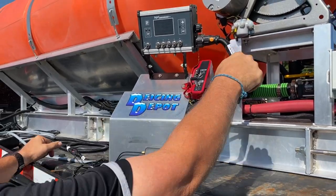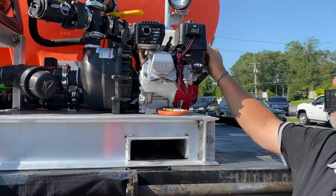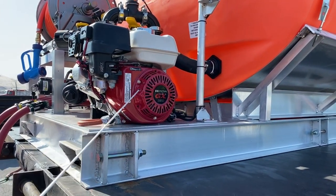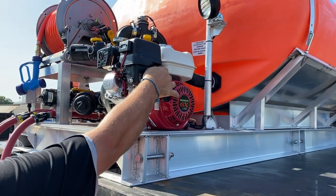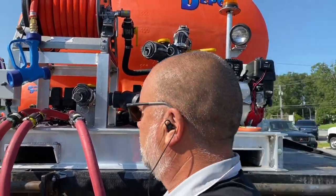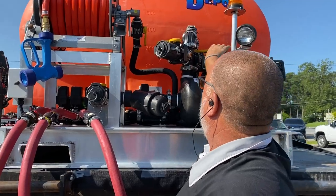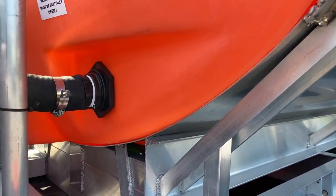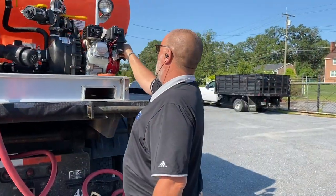To start the unit, turn the key on. Because we do not have an electric choke — it's the first thing that goes bad — make sure the key's on, choke it, turn your gas on. Once the motor is running, we're going to set our back pressure handle cracked open. Up here is your back pressure — follow it to the tank. When the motor's running and you're not spraying, the pressure inside the pump is going back into the tank, so crack it open.